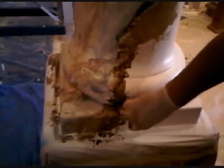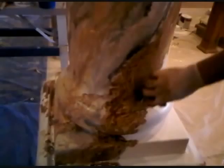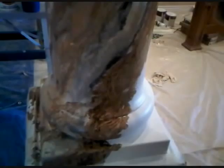And I'm placing that brown next to that black, trying not to touch the black, maybe leaving a little white, but yet running it through the other areas. Keeping a very fluid motion, very organic, twisting, turning, leaving heavy spots, dark spots, working in a specific area, maybe blending it into another area, always in the same direction of the shift of the marble or the motion that you perceive the marble was formed. That's what you're trying to imitate, a rock that was formed in the mountain.